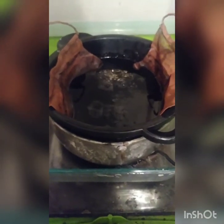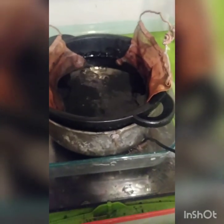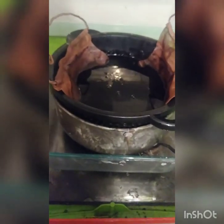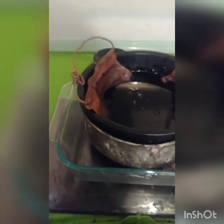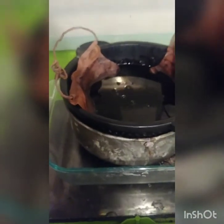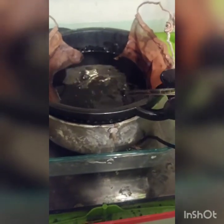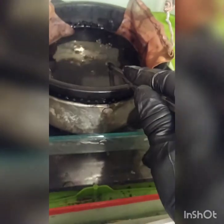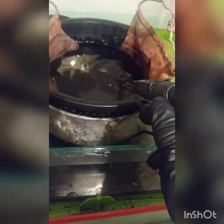There it goes — see that? Back to sulfuric acid safety: I remember working on a cell one time — I had gloves and was wiping my hands frequently. I use baking soda to neutralize any burn I feel. I'm wearing short sleeves, which isn't the smartest thing. If you touch your arms on this bowl or dish, you'll feel it when the acid gets on you. This stuff will eat your clothes and burn you. I had some splash in my eye one time.